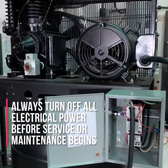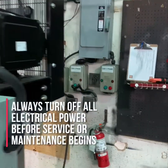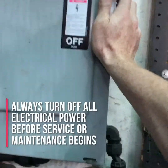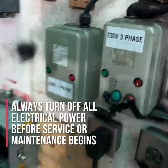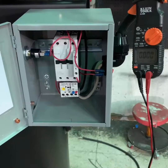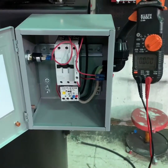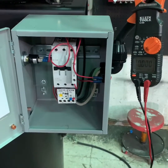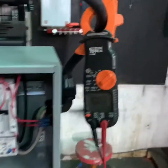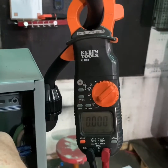The first thing you want to do before working on any electrically driven air compressor is to make sure the compressor itself is turned off, the power to the compressor is turned off, and if possible, that the air compressor is unplugged from the power service. Once you've turned off the power and disconnected any additional power sources, use your multimeter or an amp probe to make sure there is no power being delivered to the air compressor.